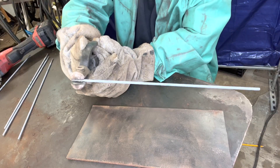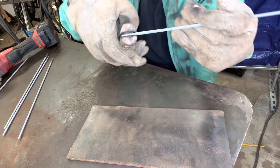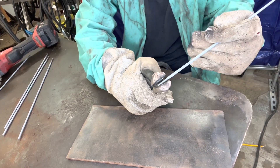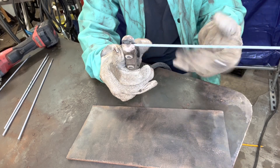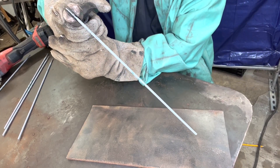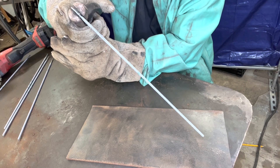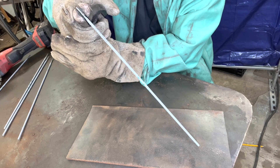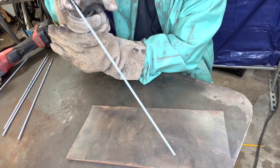Alright, let's get a little bit better view of the welding rod into the stinger, just like that. It's really, really simple. What I mean by just being really gentle about it is: if you're putting too much pressure when you're striking an arc, you're gonna stick. And if you're not putting enough, you're not gonna be able to hold your arc.